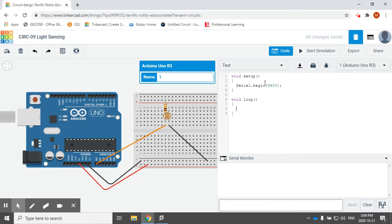I use serial.begin and 9600 is the default baud rate. I'm going to use that to print to the serial monitor, which gives me some text output as I'm running. On the actual Arduino IDE it gives me a chance to set the baud rate. 9600 is the default, so as long as I put that in it'll work on Tinkercad and by default on Arduino as well. Now I want to do an analogRead because I'm reading in from the analog value, and the pin number I'm reading from is A0. I can use A0 or just zero — analogRead zero will know to do A0 — but I always put A0 because it reminds me I'm hooking up to A0, not accidentally pin zero.